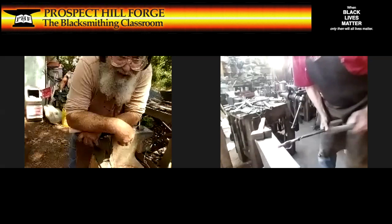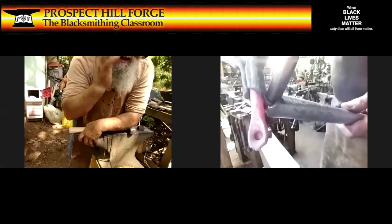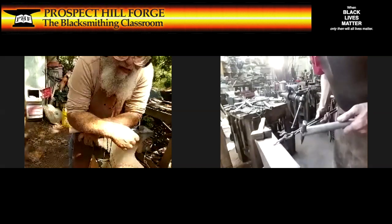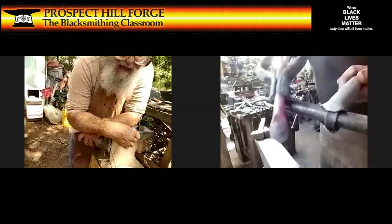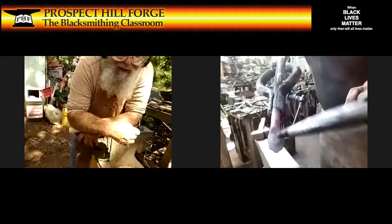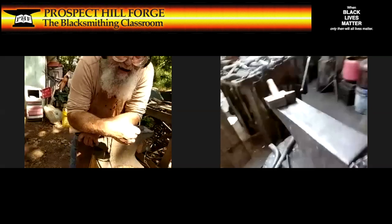And, all right, so what just happened there? I don't know how much of this you can see. It went dark in the middle while it was still kind of glowy around the outside. And that's my sign that I have gotten to where I've got a shiny spot. Do we see this? Yeah. Shiny circle. Yep. That's my guide for placing the punch on top. All right. So that was the position holding it with tongs.